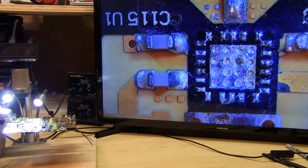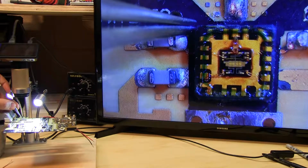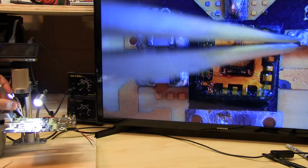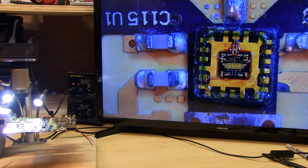So with the orientation marker, the pin 1 marker, in the right position, I'll lay the part down on top and position it as best I can, and start flowing it from underneath. The good thing about flowing both QFN and DFN parts, and most parts, is that once the solder starts flowing and things get heated up, if you have a good solder mask pattern and the leads or the pads are contained in solder mask, if you position the part well enough, the part will self-align.